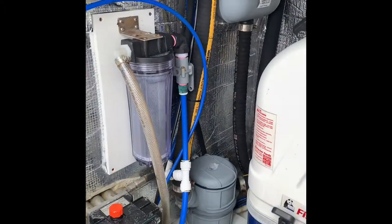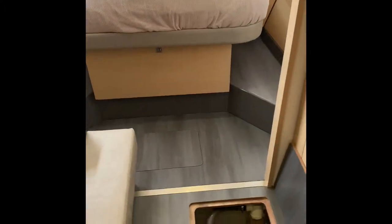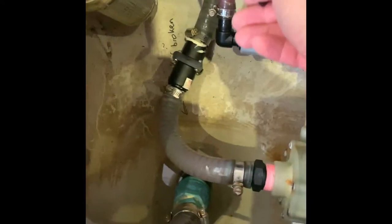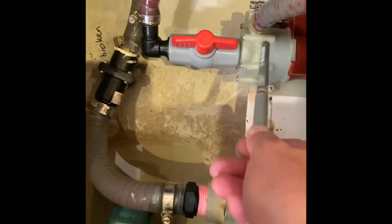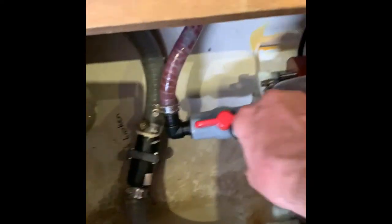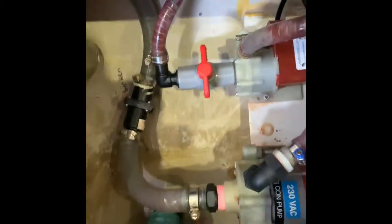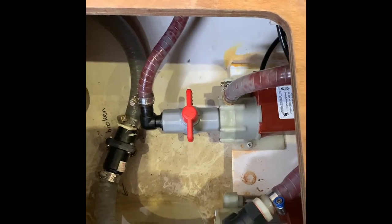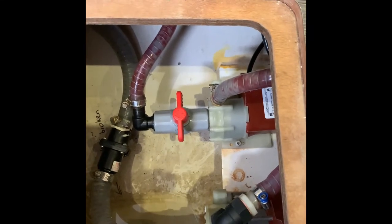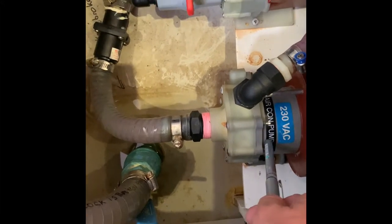In the next step I show you where to close that valve. Here in the master bedroom we have the sea cock, the filter, and two pipes. This is the shut-off valve I installed for the booster pump. While the fresh water is open, just close that valve — with that closed, there's no fresh water rinsing back into the sea, and now it's rinsing through the entire watermaker.